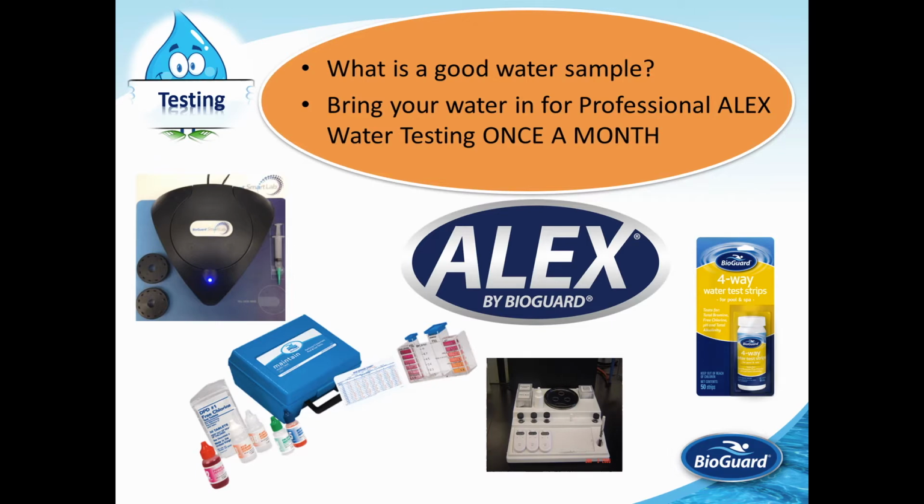If you're going to test your water, you need to go elbow deep into the pool to get a water sample, away from your return jets. You don't want to grab water that comes from right in front of the return jet because it's been chemically treated and it will skew your results a little bit. So elbow deep away from your return jet.